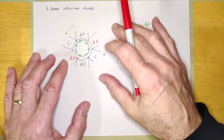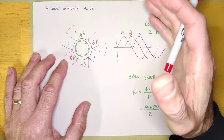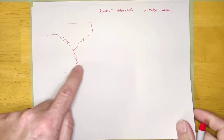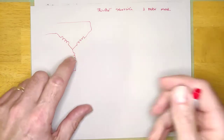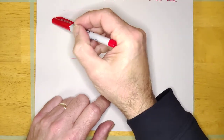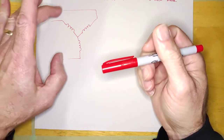If you get your ammeter out and the motor is running and tripping out overloads, you can put your ammeter on the three wires that are entering the motor. It could be Y, it could be delta — it doesn't matter — but it's going to have three-phase windings wound on the phase poles. You can clamp on each of the three wires and see what the current is.